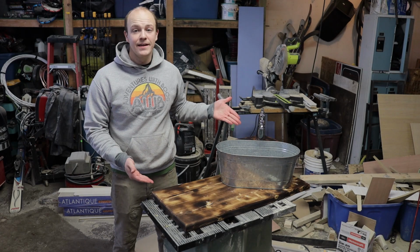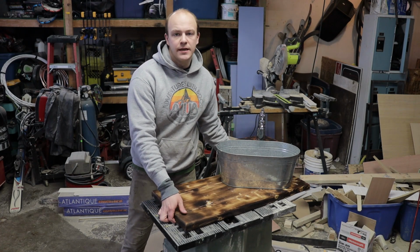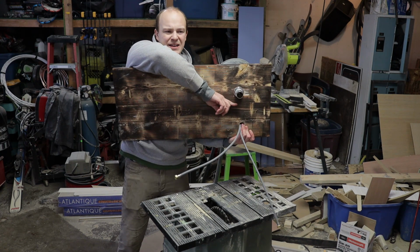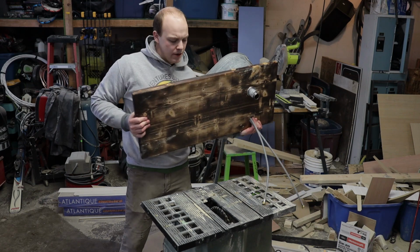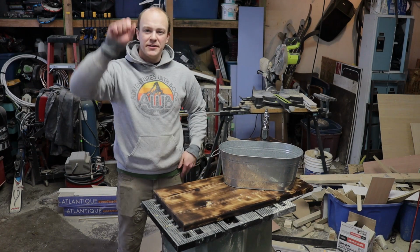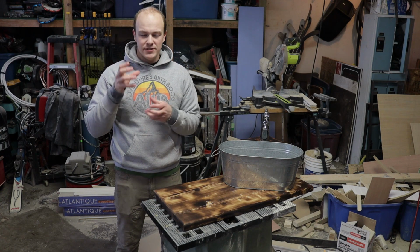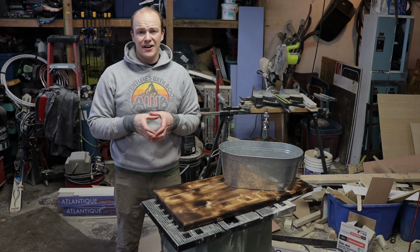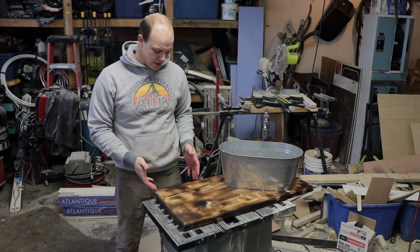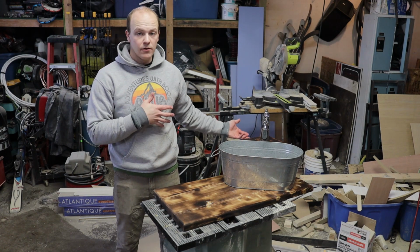We have the vanity out of the bus, as you can see. In order to put the drain on the bottom of the vanity, this nut right here was very, very difficult to do in position, because you're up underneath the vanity and you can only turn about 1/8 of a turn, and you have to use the plumber's pliers because the nut is like a 1.5 inch nut. So luckily, this is all one piece, and we can remove it all as one piece and install it all as one piece.